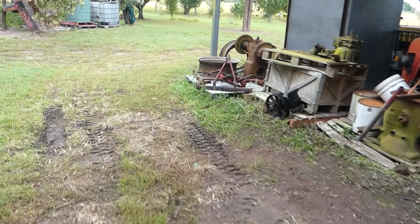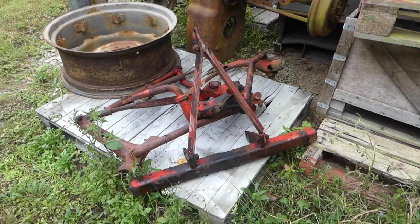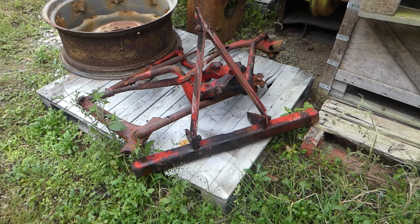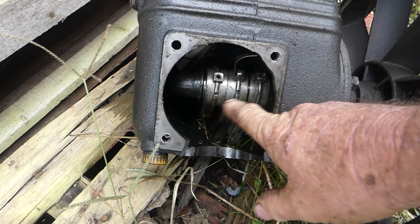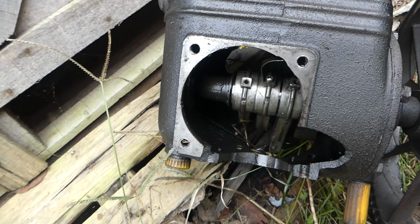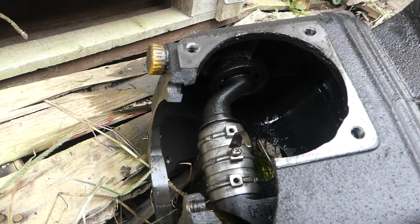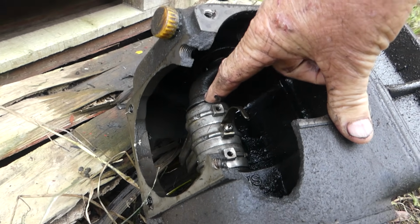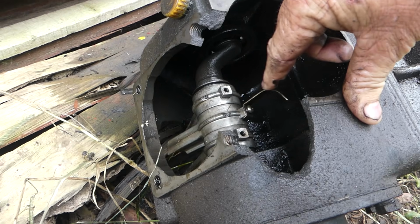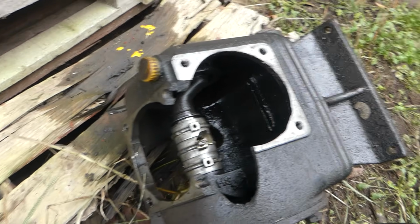And an interesting thing, these fellas here, they were all the scufflers and bits and pieces on it, but there's many bits missing, so I've discarded them for the moment. I might get back to them some other time, but not now. And when we look down here, this is the body of the compressor. Now, there's 3 conrods here, 1, 2, 3, and I thought, how the hell do they get them on? Because the crank's got a bend in it there. And what happens is they're small enough that they come over this section here and go on, and then there's a bloody circlip and a washer holds them on. Probably not how I would have chosen to do it. And then they've got an oil flinger to splash all the oil up. But that's what's left of the compressor.